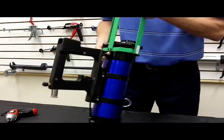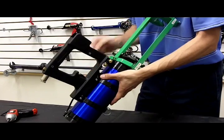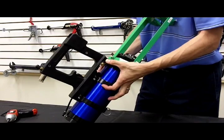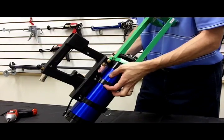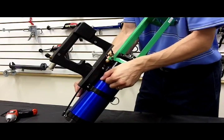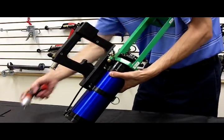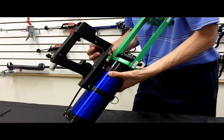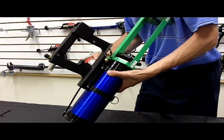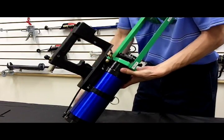And then the way I do it is I lean it into my chest like this, and I get everything lined up the way I want. Make sure your forward reverse brass knob is centered, otherwise it can get in the way when you're sliding this up. And I simply slide it up until it locks into place. And you'll find it's kind of like a puzzle piece. You'll see if it's not set right. And then while holding it there, make sure it's straight.